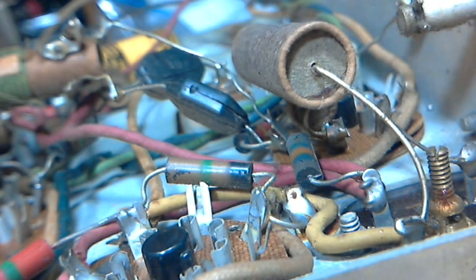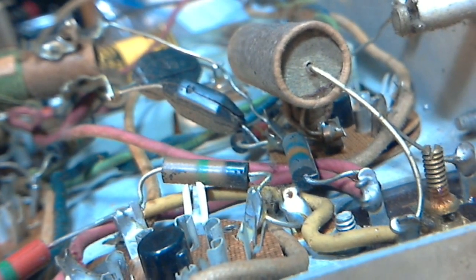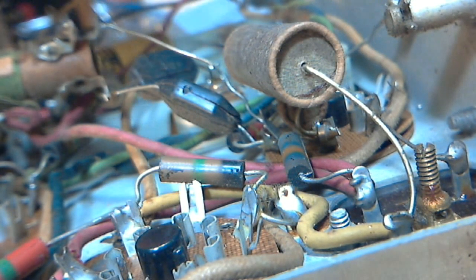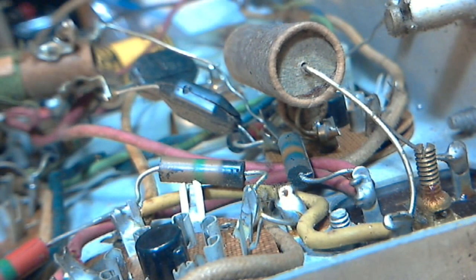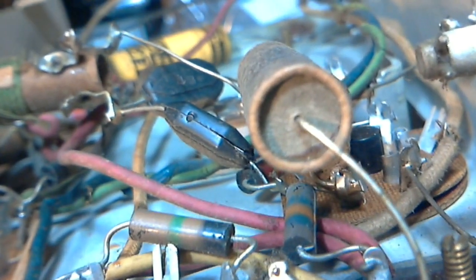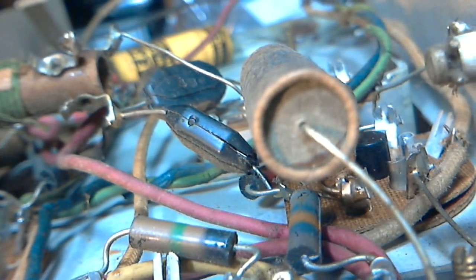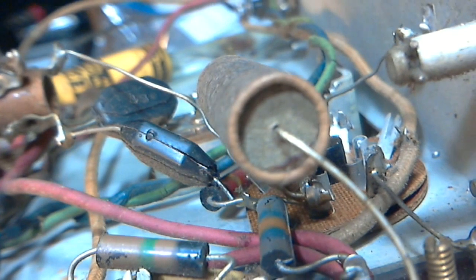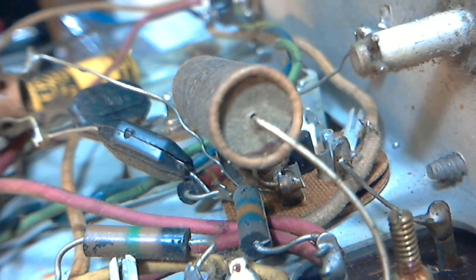Strange approaches that I am taking. Oh, okay. There we go. So what we're going to start with here in terms of making a repair, going to start on this capacitor right here. If you look at it closely, you can see that it's actually cracked right down the seam, and you can see right inside the capacitor. So that's what happens to these guys.